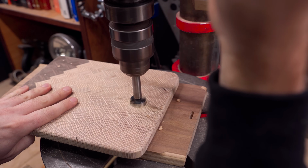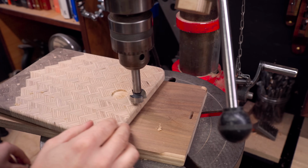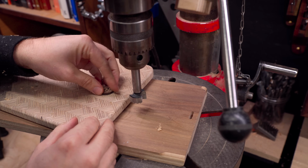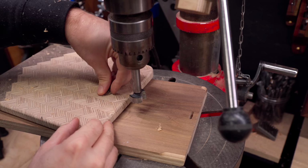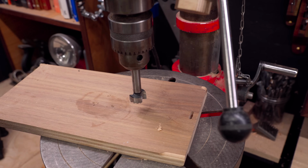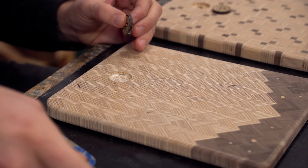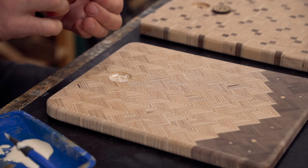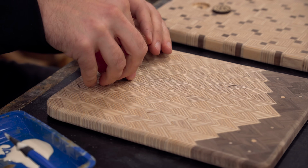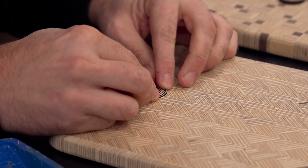And now for the nerve-wracking bit of drilling out the boards that I just spent hours on. I slowly crept up on the cut, making sure that it sat at the right depth. Fortunately, the laser cut deep enough that if it was sitting a little bit high, I could sand it down. I also sanded the blackened edges to make sure that I get a good glue bond. After that, all I had to do was apply some glue and slip them into place.